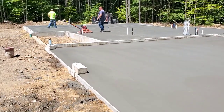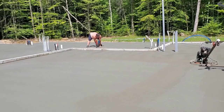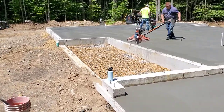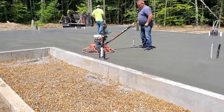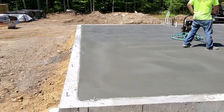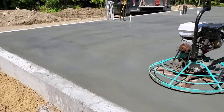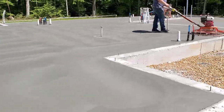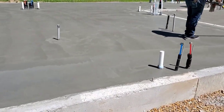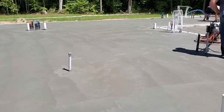It's 11:30 now. The garage has been all floated and I've hit it with lay-down blades in the back. The house is just about done. At 11:30 we started power troweling it right around 10 o'clock. You can see this back half is about to shine out already. That part there is done. This piece here is just about done — it might get done on this head or we might have to hit it one more time. Got done pouring at 8 o'clock and the house is just about done power troweled by 11:30.